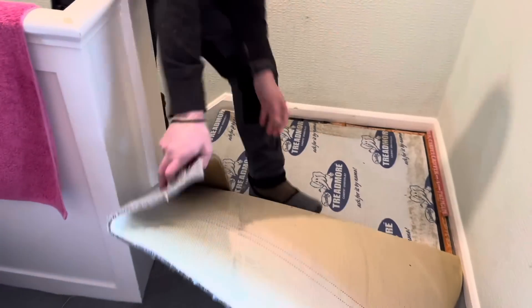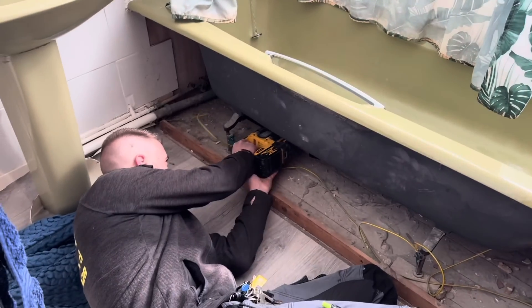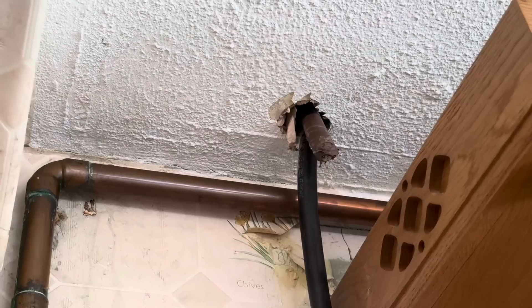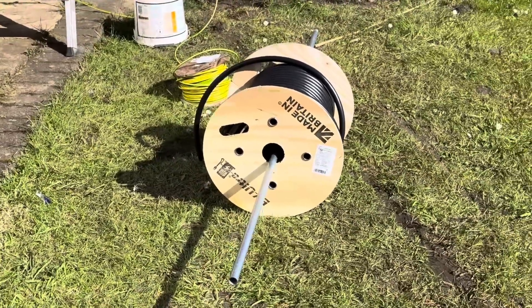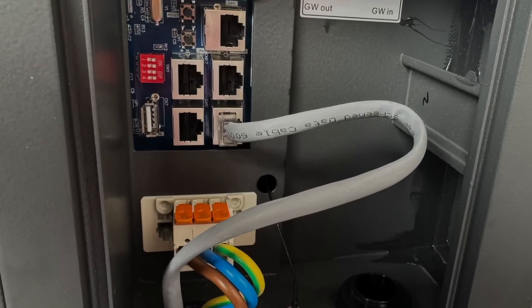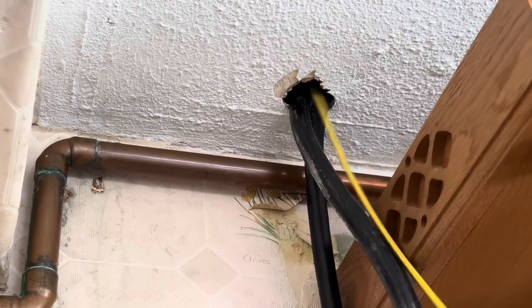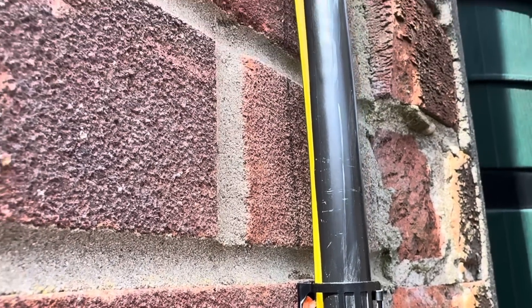The cable run follows the same route as a cable fitted when the EV charger was installed. The floorboards come up a breeze and David drills through above the conservatory, leaving spare cable in the floor space as the conservatory is being removed in a few months. The cable being used is the EV Ultra from Doncaster Cables, because a data connection is required between the Give Gateway and the all-in-one. We also have a six millimetre squared cable from the Earth electrode following the same route. Using clips from D-Line, you can fit the six mil in the base and the EV Ultra on top, securing them away neatly.